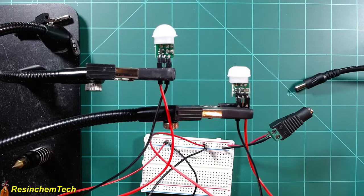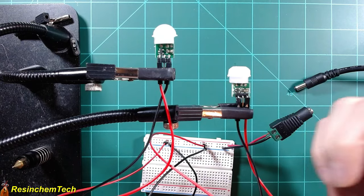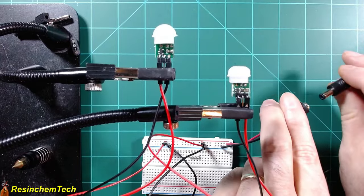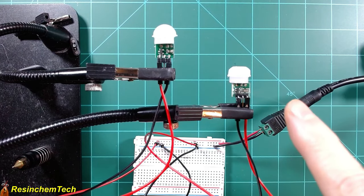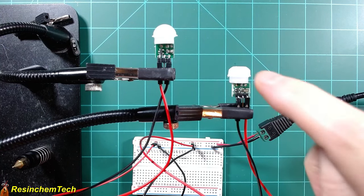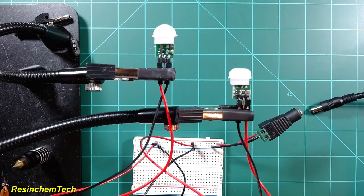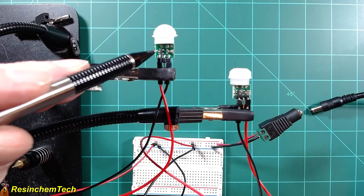I've hooked up power to both sensors. The one with markings is correct; the one without markings I've intentionally wired with positive on the right and ground on the left — just to show what happens when you apply 5 volts with reversed polarity. And there it goes — we've got magic smoke, and I've immediately fried this PIR sensor. That's why it's always important to check the diagram that comes with the one you buy. As a general rule, the positive connection will be on the same side as the voltage regulator, but check the documentation to be absolutely sure.